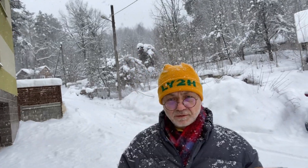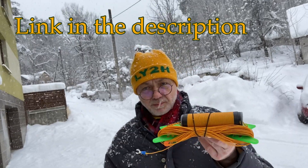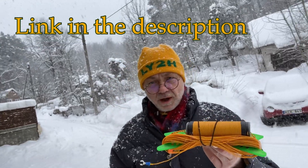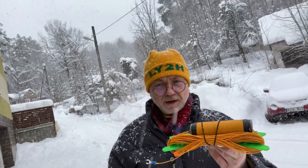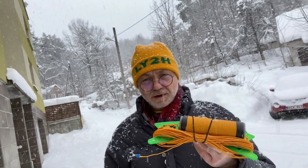There's no way to repair it now in such heavy snowing, but my emergency situation is that these coming days we have a nice national contest to celebrate National Day — a 30-year tradition — and I would be very sorry to miss it. There's no way to repair the big antenna, so I found my Shorty 80 to 10 coil-loaded, my favorite portable antenna, which I'm going to deploy today zigzag from my window into my backyard and see what happens.